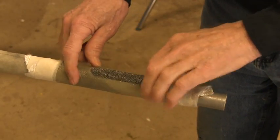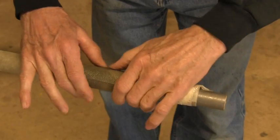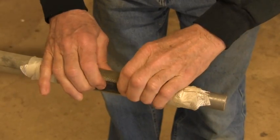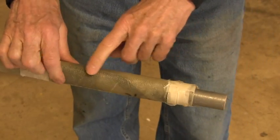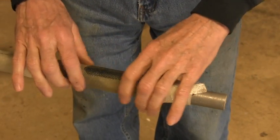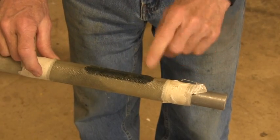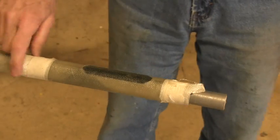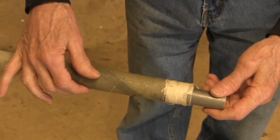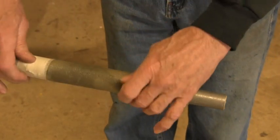The epoxy is cured and seems to be fairly stiff in there. I remember we added that layer of 3-inch tape over the top after the wrapping. Let me go ahead and clean this up and get rid of the boogers so I don't cut myself. There's a little bit of selvedge on here, some roughness, I want to sand away on the edge.